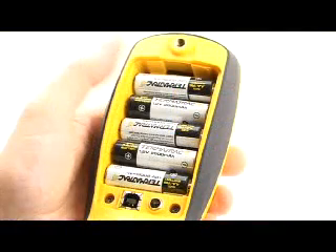The power LED will light up yellow momentarily and then go out. This indicates the device is operating correctly. If the power LED does not go out, or if other LEDs are turned on, this may indicate an error. If this occurs, make sure the batteries are fully charged and that they are inserted correctly. If the unit does not respond, contact your nearest Termitrac calibration centre.